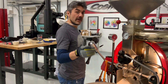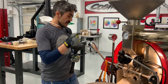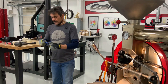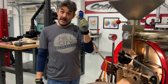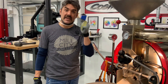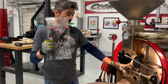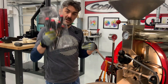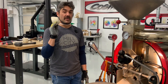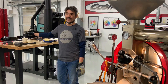I have a small flashlight, because a nice flashlight will really help you get a view in there. Your drum light or roaster light will work partially, but it's dark in there and we're looking at a gap — a spot of darkness — so a flashlight to get in there a little bit better will definitely help. Then I have some Allen keys, some bent ones, so I can stick them in the gap. These are for measuring the gap to find where I'm at and then measuring post-adjustment to see where a happy gap is. I also have Allen wrenches for the set screws in the bearing that I have to loosen to move the drum. And I have some cupping bowls to hold nuts and bolts so they're not lost or can be kept in groups.